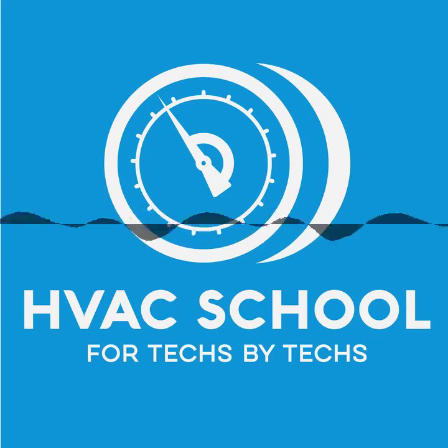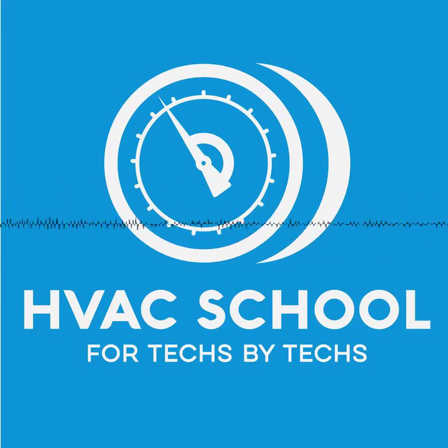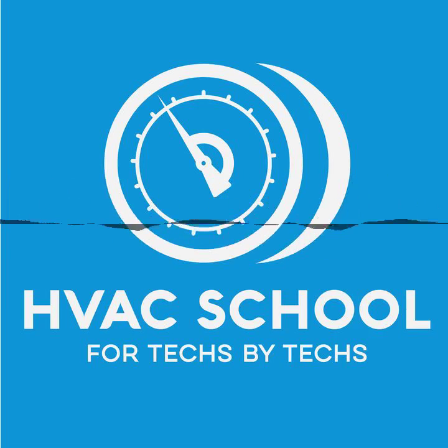I went and watched an AeroSeal being performed and felt the product — felt how it maintains its elasticity, how it can stick to two different surfaces, and really maintain that hold for years and years. AeroSeal, if you guys don't know, is a product that can seal up air conditioning ductwork similar to fix-a-flat for a car tire. It automatically goes and finds the leaks and seals them. We do that by isolating the duct system — we put closed-cell foam plugs in at the unit as well as at the supply and return registers. We pressurize it, introduce an aerosol into the pressurized system, and wherever there's a leak, the AeroSeal is drawn towards that spot and starts building on itself and sealing the leak. It can seal leaks up to five-eighths of an inch.